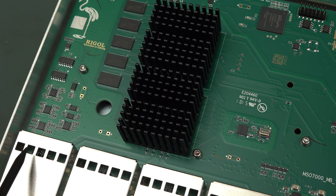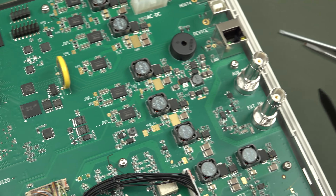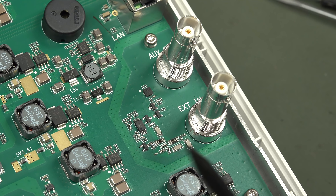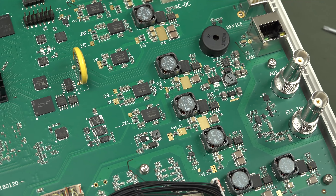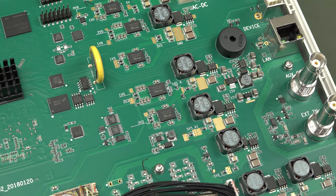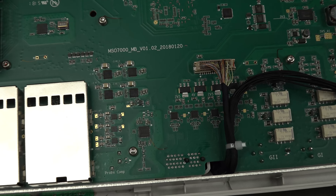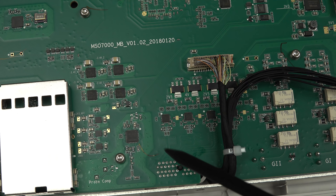There's remarkably little inside here: ADC, Phoenix chipset, sampling memory, and some miscellaneous stuff down here. This is not the external input — that's all the way over here. There's not much circuitry around the external input. It's good that you get a four-channel scope with an external input so you don't waste one of your channels if you need an external trigger, though it can't give you a fifth waveform.